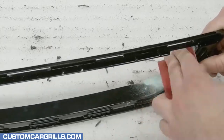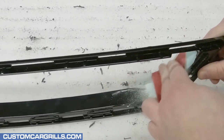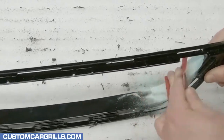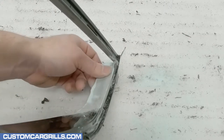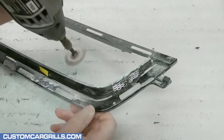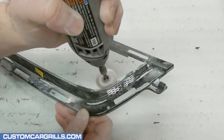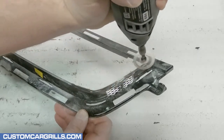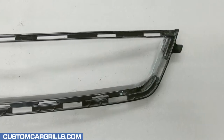Now it's back to sanding again for the final time. I'm starting with 100 grit and then finishing off with a finer grit near about 300. This is where it needs to be very smooth to the touch as well as even and uniform. Once I'm happy with the feel of the edge, I'm going to trim the back of the edge with the cutoff wheel. I want a nice crisp line on the back so that it looks like it came from the factory this way.